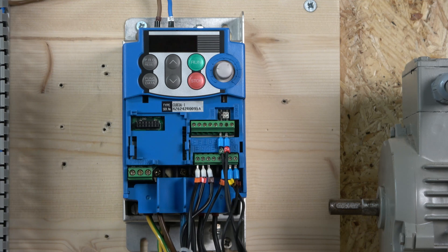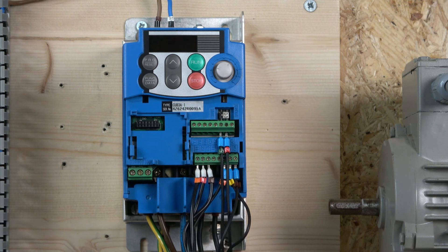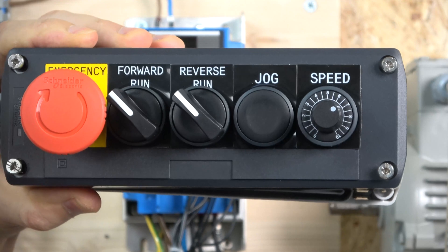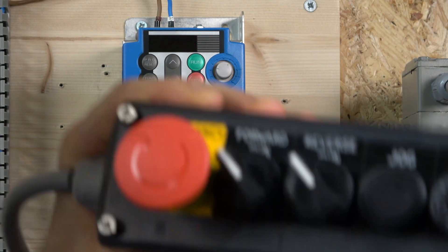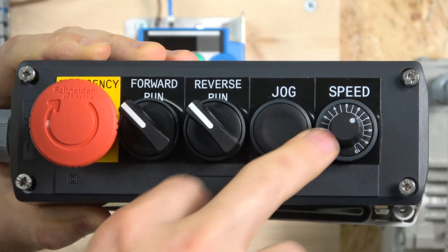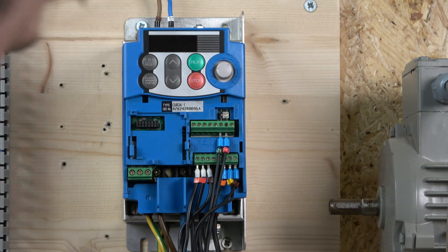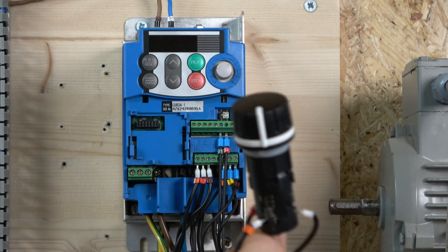So the first station is the 2-wire setup. We're going to have an emergency stop, which acts as a quick stop — if you're not using any external systems to shut it down, it will do that internally within the drive. We also have run forward, run in reverse, and we're going to implement a jog button. For speed control, we have a potentiometer — for this system it is between 1 and 5 kilo ohm.